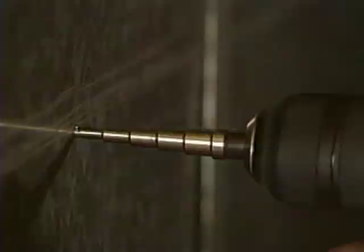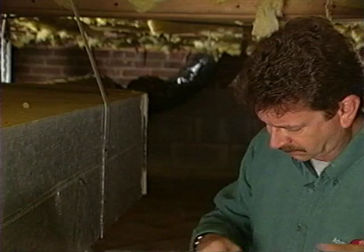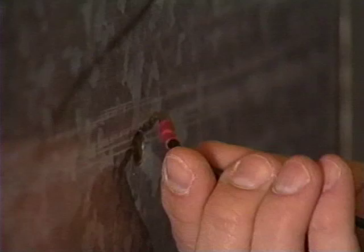Next, drill a hole in the supply ductwork. Be sure to locate your hole so that your temperature probe is out of view of the heater elements. The radiant heat from the elements will give you a false reading. You want to measure the air temperature on the supply side. Now, you're ready to insert the probe and get your reading. What you want to do is keep the probe as close to the center of the ductwork as you can.